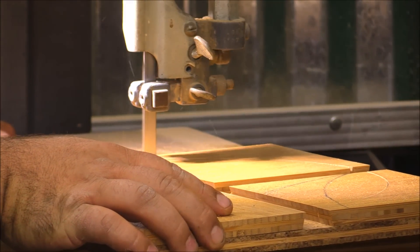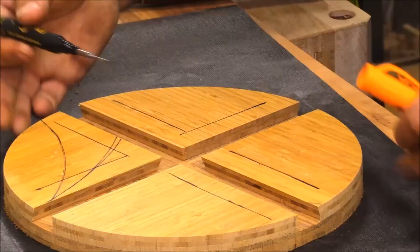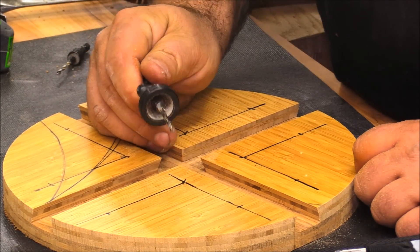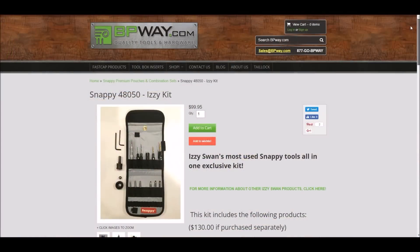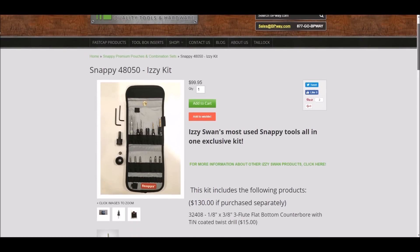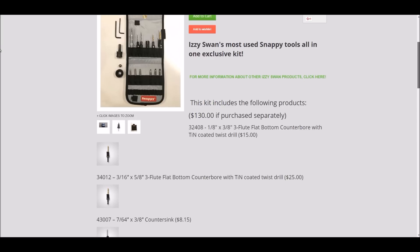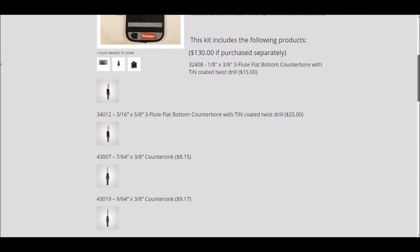Once I have this all cut out I need to secure those panels in place permanently. I'm marking out three hole positions on each block and drilling a countersink. I'm using my flush-cut countersink, which has a little ring on it that stops it so it will only go so deep — really nice for controlling the depth of the countersink. I ordered mine from bpway.com; they're made by Make It Snappy Tools, which makes an entire line of really high-quality countersinks.